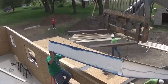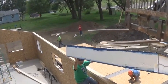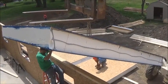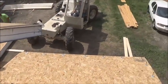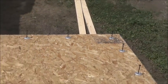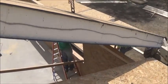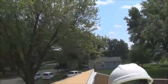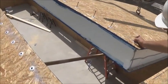Here we're bringing up a roof panel. We have it all prepped — the other side has the box spline already installed and caulked, just like we've been preaching the whole time. This side we have it all caulked and ready. We have the spline in this panel, number 24. Notice also on the roof panel, the bottom left has the stamp and number on every one — that's how we know we got it in right on the top skin. Up on the valley, we have it cut back about three quarters of an inch at the peak. Notice our zip tape that we had before is in line.